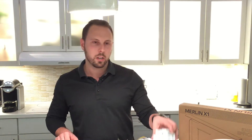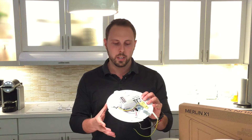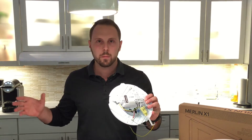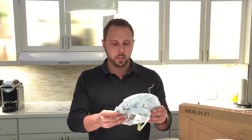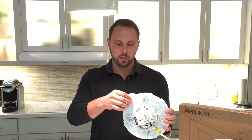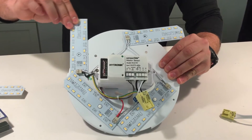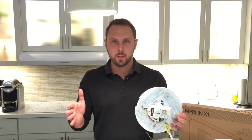I'm going to start with our LEDCR module shown right here. This is a circular retrofit designed to retrofit existing surface mount drum fixtures, sometimes used in pendant fixtures, and it has a few very unique features. Basically it's a nine inch diameter disc and you can see that there are four LED boards on this unit. The LED boards are designed to swing out, so this one unit can fit a number of different sized fixtures, anywhere from ten inches in diameter all the way up to maybe two feet in diameter, and illuminate those fixtures uniformly because these boards can spread out. It's very flexible.